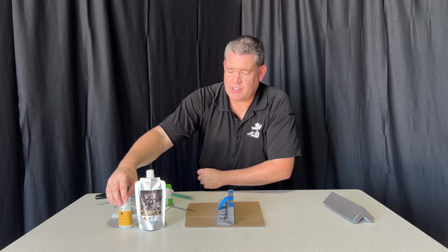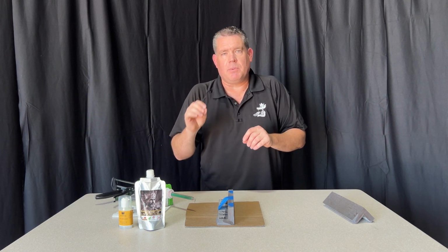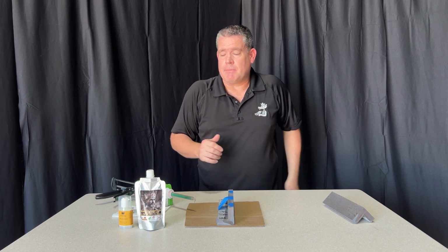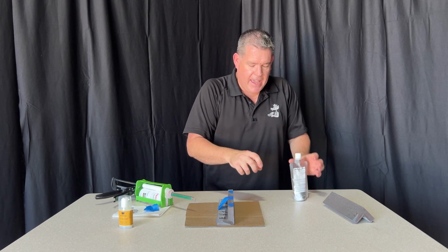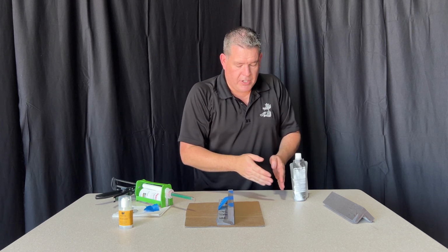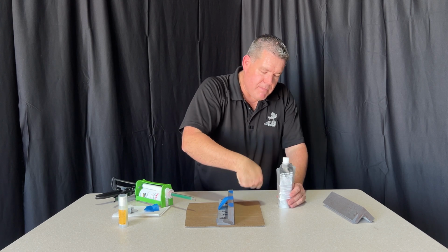My thoughts are this. When it comes to doing miter edges, you are working fast. You have a ton of adhesive to put down. It needs to be flawless. Your customer is going to see this. It is a long seam. If you're mixing it up and adding your adhesives and kicking it off, all of your hardener is put in at one time. You put in all your hardener, you have mixed that now, the clock is running.